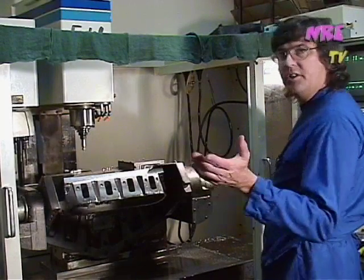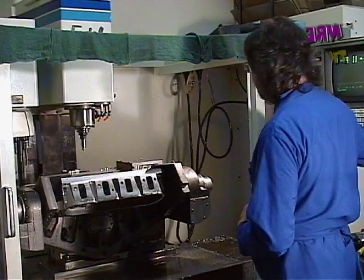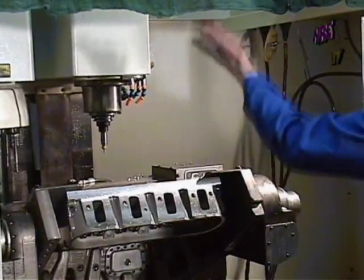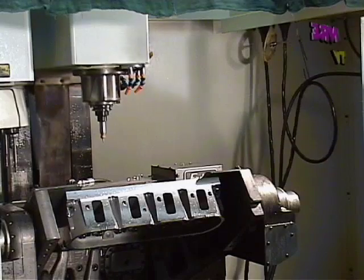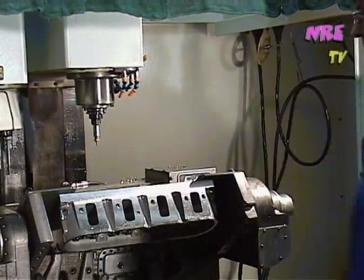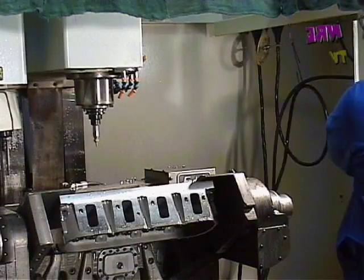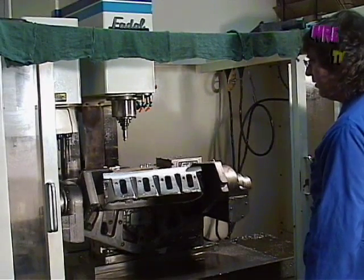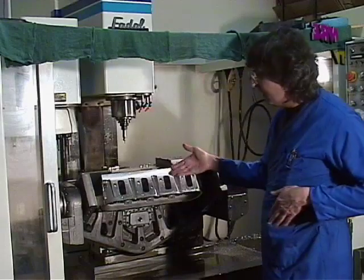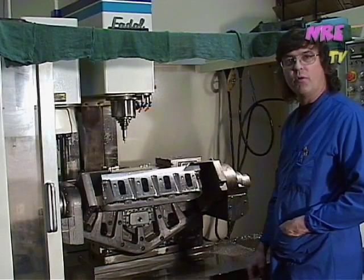We have five ranges of motion — five axes. Left and right is our X direction. Forward and backward is our Y direction. We can move our spindle column up and down, which is our Z direction. We have one rotary motion, our A axis, which rotates 360 degrees like a barrel. And then we can articulate in the B axis, which gives us our tip or teeter — that lets us get around push rod bends and corners you might not otherwise reach with a four-axis machine.